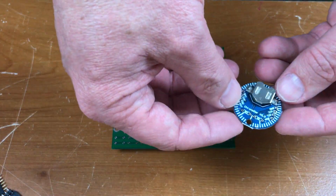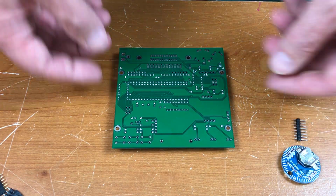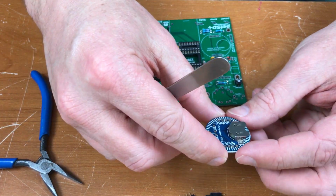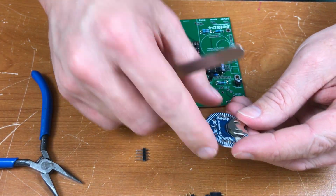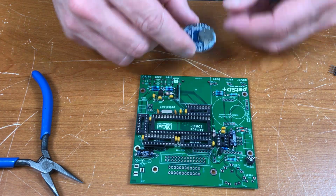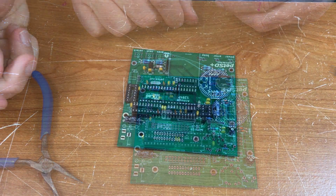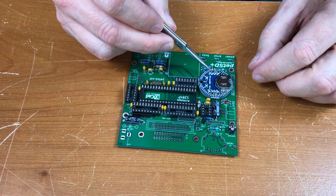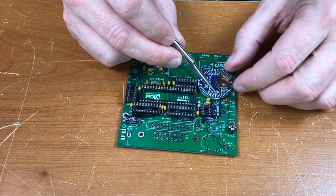Next up is something called a chrono dot. There are a couple of spaces on the silkscreen here for some resistors on this, but none were included. I'm going to assume they're not needed. The silkscreen shows a smaller circle on this side, so I assume that's where the button cell goes. So checking the schematic, this is the correct orientation. Reset here and ground and VCC here.